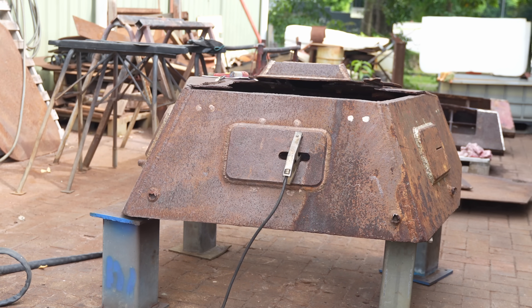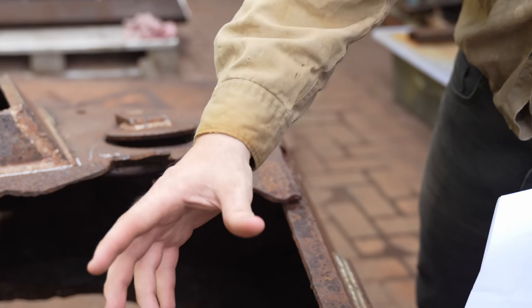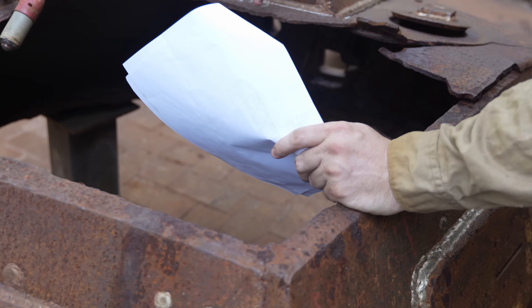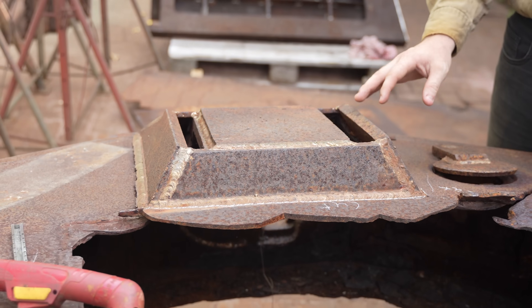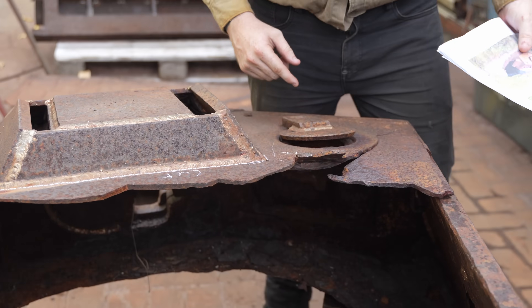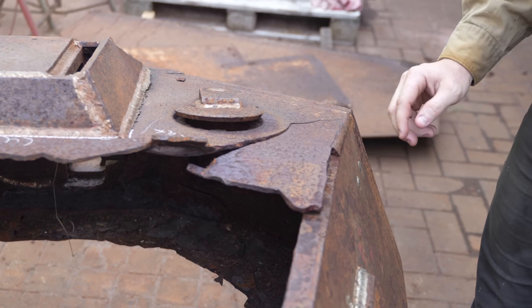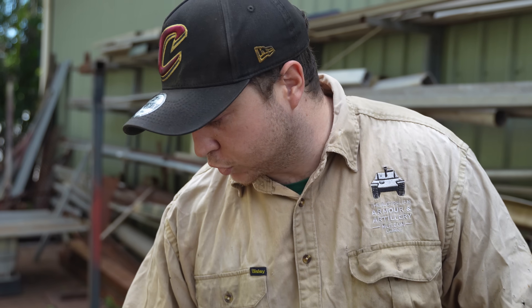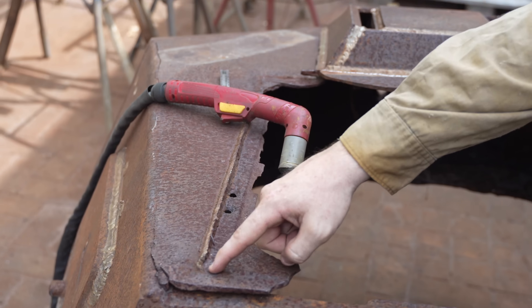You can clearly see this piece has been blown out and ripped off, and the piece attached to it has also been blown out. We want to cut this piece off, straighten it, and then try to straighten the existing roof. You can see where the bend was — there would have been a press line running through where that angle meets. We'll get that down, push it back, cut all that off, put a new piece in, and then cut our new top which will run from there to there and across, then get fully welded on.